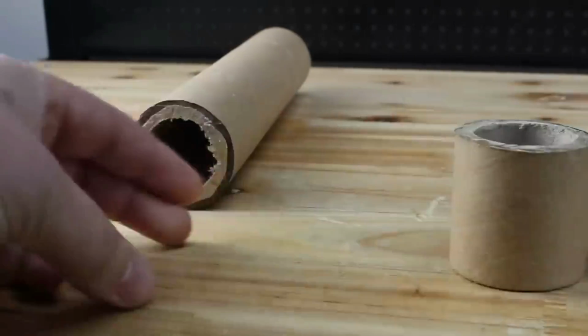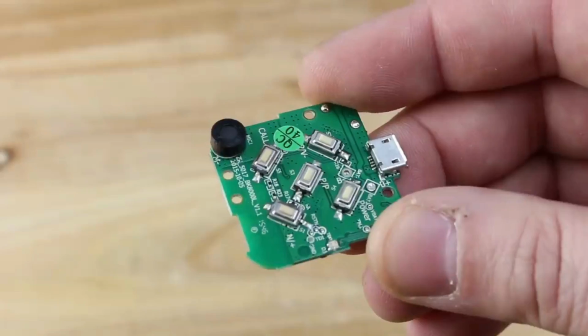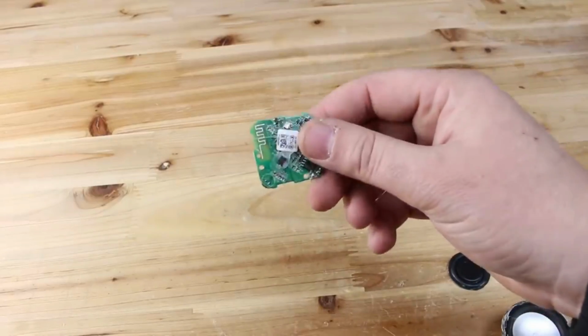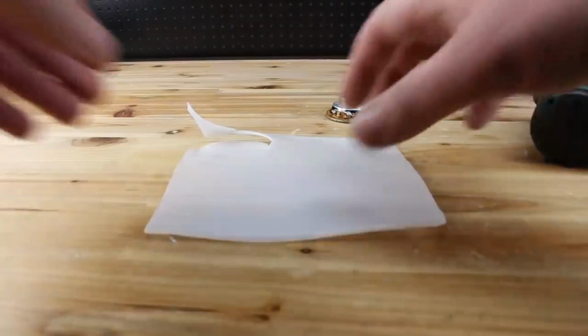Main module with integrated audio amplifier and Bluetooth receiver. From here I have soldered the speaker and LiPo battery. Basically you need a Bluetooth audio receiver, audio amplifier, LiPo charger and LiPo battery, all on this tiny board. Amazing! And a custom made mini case for placing all parts.